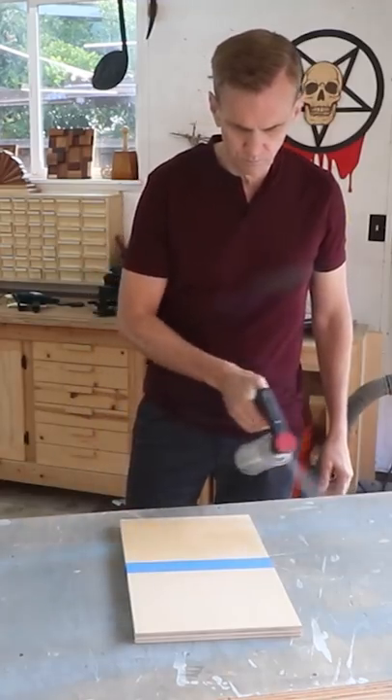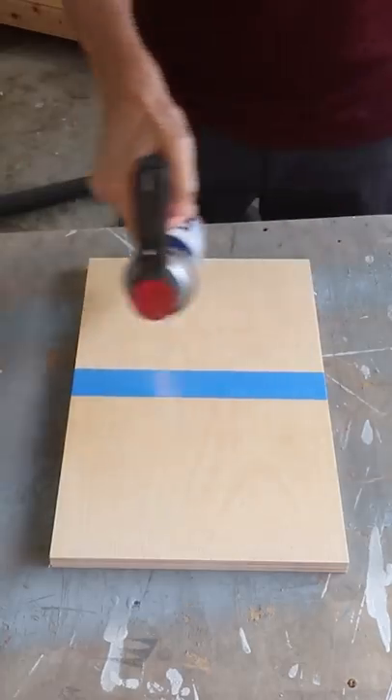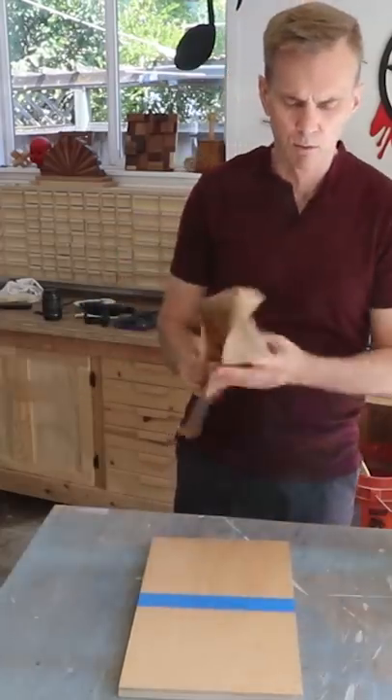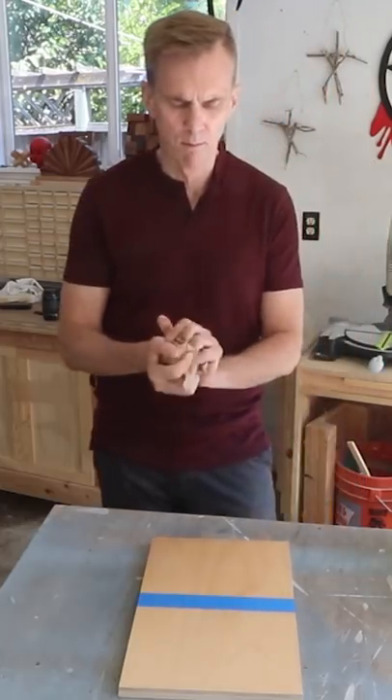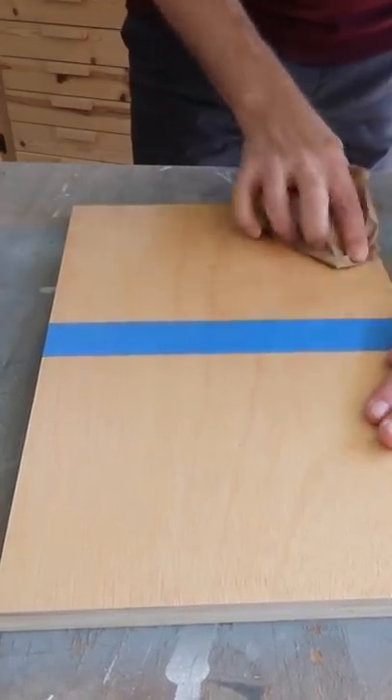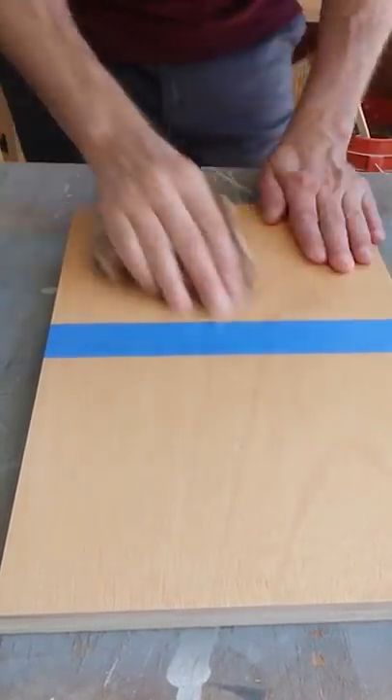For this demonstration I'm using spray lacquer. This also works really well on polyurethane and other varnishes. Once your finish is completely dry, take a crumpled up paper bag or a piece of craft paper and just start buffing. This will remove all the tiny dust particles and nibs and smooth out any imperfections.